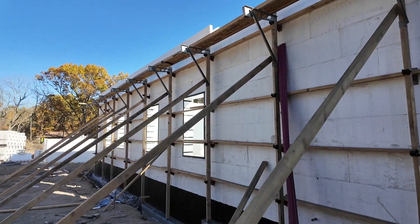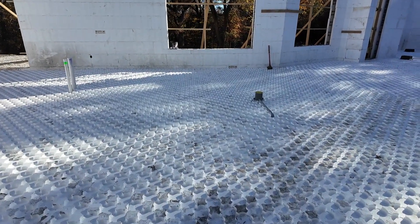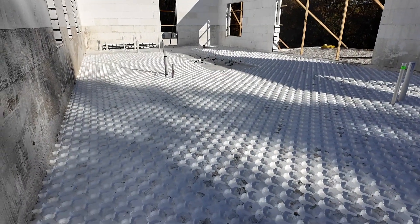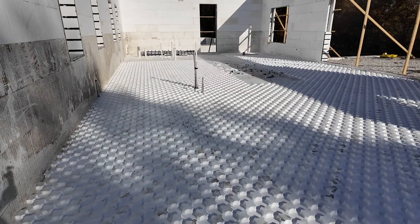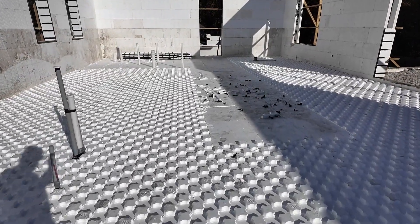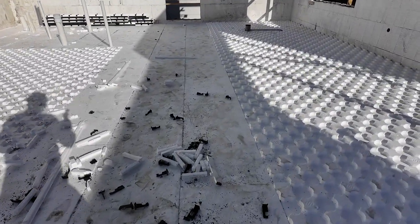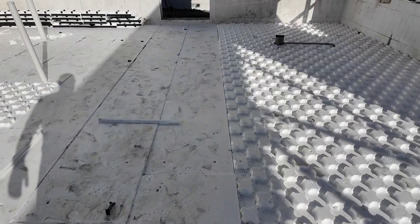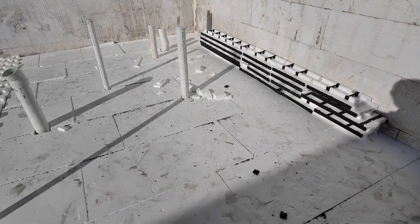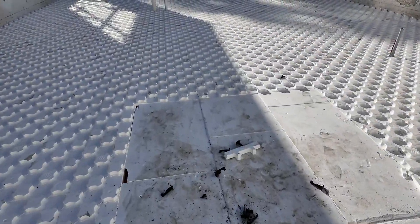Boys just got done with an eight-hour day. They got some of the walk planks up — we're using TGIs for the second floor, they make excellent walk planks when you have them available. We've got all of the heat sheet HD, or the heat sheet heavy, laid out. The pucks are on four-inch centers on this stuff, so most of our hydronic is on eight-inch centers. You can see the area where we use the regular non-pucked heat sheet right here — this is kind of where the trunk lines, or all the service lines that run to each different zone, lays. It's on like two-inch centers here and they don't really make a puck for that. So tomorrow morning I've got to go to the supply house and get a bunch of five-by-ten wire mesh to just lay on the ground so I have something to tie it to and keep it organized.